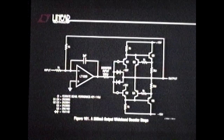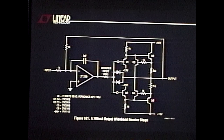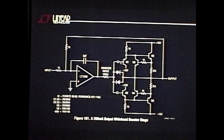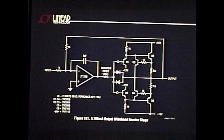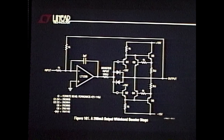Question about the circuit: yes, it's symmetrical — here's a follower, here's a follower, those are the current ones. What does the ferrite bead do? The ferrite bead looks inductive at high frequency, and the transistors want to see impedance at frequency to prevent them from oscillating. Usually you can get away with one or the other — a real impedance like a 100-ohm resistor, or a bead. In general, if you want to spook your audience, always use a ferrite bead because no one knows what they do.